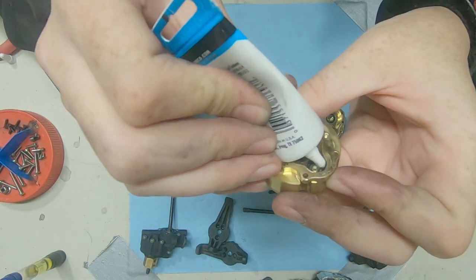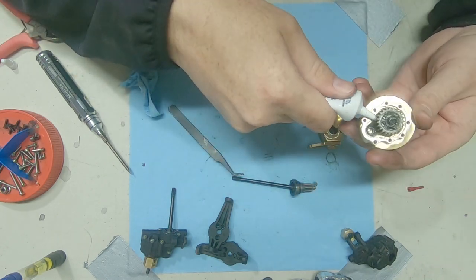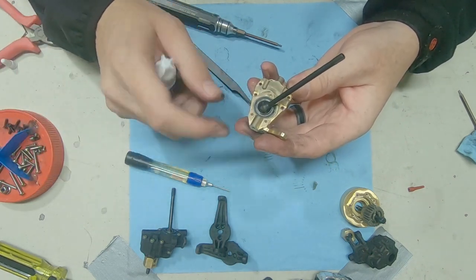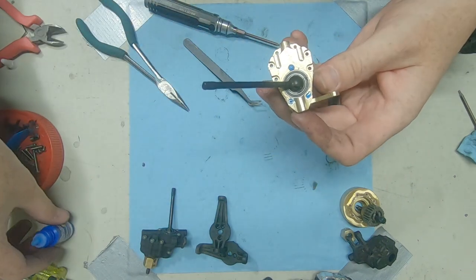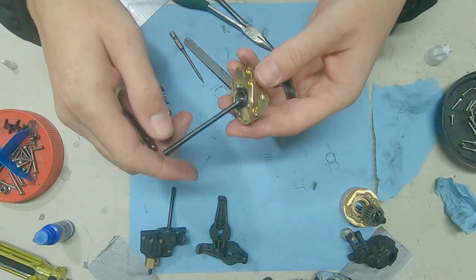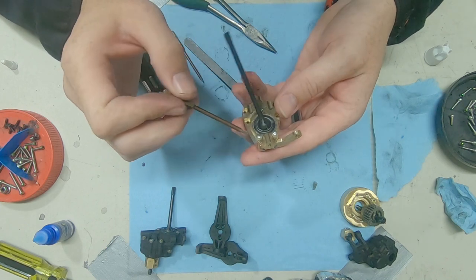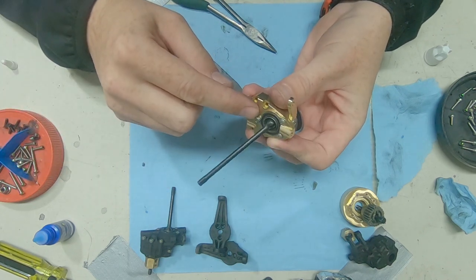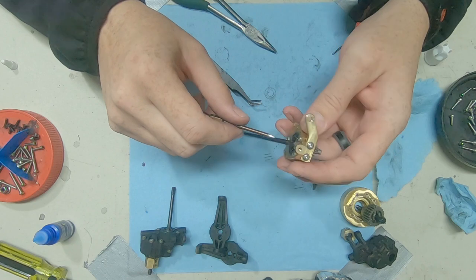We're going to add a little grease in there, then put the keeper screws back in for this bearing. Since we'll have steel on metal in these holes, we're going to use a little bit of blue thread lock. What I ran into here is that the bottom hole isn't as deep, so the standard keeper bolts won't work — but they did send a super short one of a different style, which should be fine since it's not in an area that will bind against anything.